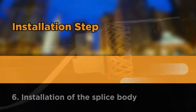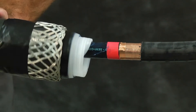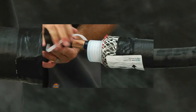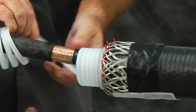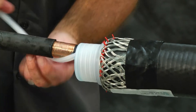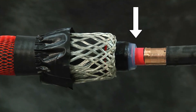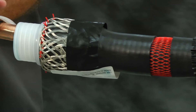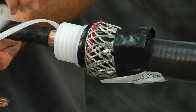Installation of the splice body. Position the splice body so that the silicone body's edge is aligned with the marking tape. Release the spiral holdout by pulling counterclockwise while holding the splice body in place. The spiral holdout cannot be pulled out all at once. Slowly pull the spiral holdout on top of the cable, then pass it around and underneath until the spiral has been completely removed. Important: the splice body must remain aligned with the marking tape while the spiral holdout is released. Once the splice is partially shrunk adjacent to the marking tape, there is no need to hold the splice. Use two hands at this point to remove the remaining spiral holdout.